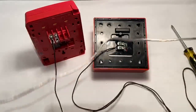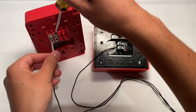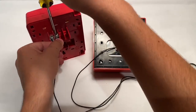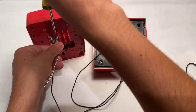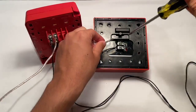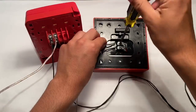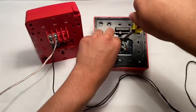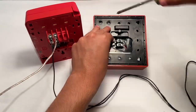The final step is to take your wire — it doesn't matter what size — and put it into the second terminal of the pull station. Then take the other side of your wire and put it into the negative terminal of the notification appliance.